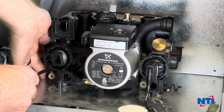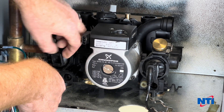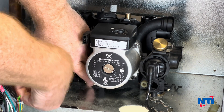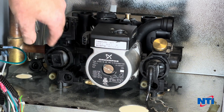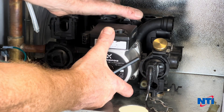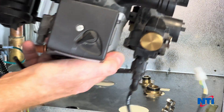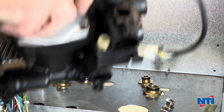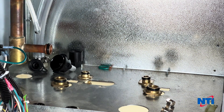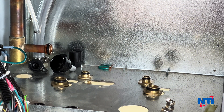The little plastic clip on the other one is sort of inside here, so you reach your finger in, lift it up, and twist it about 180 degrees to unlock it. At this point the IWC is ready to remove from the boiler. Rock it back and forth and pull it up and out — and that's the IWC removed. These four O-ring connections remain in the boiler with your plumbing connected to them. Lubricate these O-rings when you go to put it back together — it does make it go back together more smoothly.